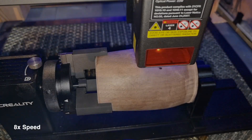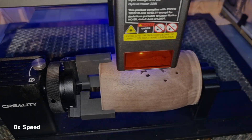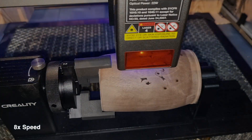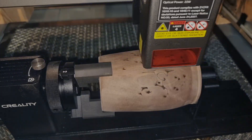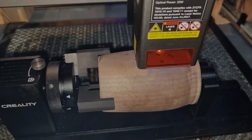All the products I will engrave today are still uncoated. Some products we coat with epoxy resin, but for engraving purposes we select uncoated surfaces since epoxy resin is not suitable for engraving.